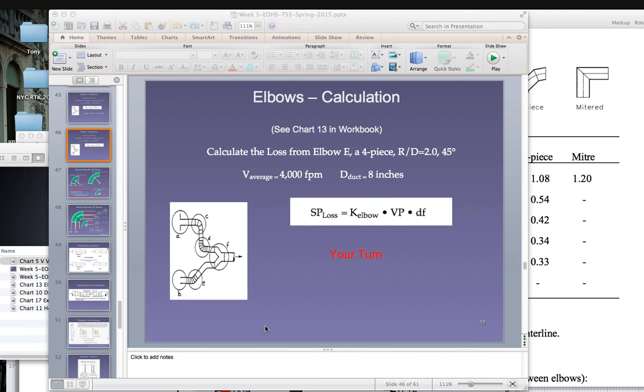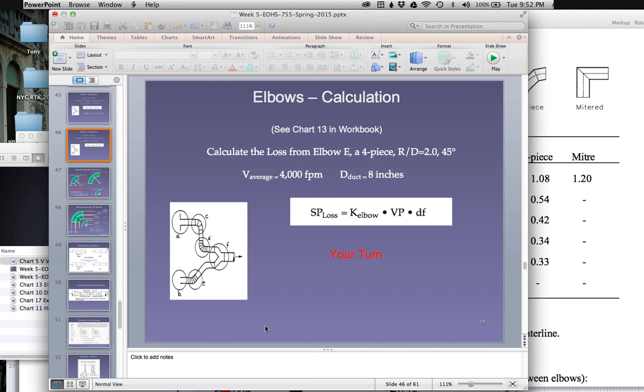But some systems are constant volume systems, they're only set once and left, and those dampers are designed to make sure an even amount of air is going into each room. And you can imagine, why don't they just simply design the ductwork so that happens automatically? It's conceivable they could do that. But they have to anticipate changes in how much space is occupied and so on and so forth. So frequently they'll design them with these adjustments. Blast gates and these kinds of dampers, we usually want to avoid them in a duct system.